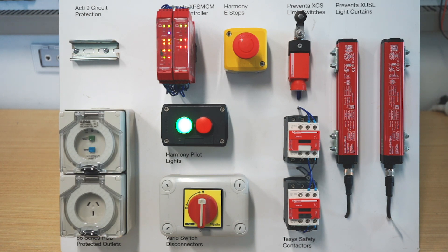The idea is that we're doing a pre-start check for possible welding of the power contacts before you start the electric motor. However, the main thing to appreciate is that what you need for your particular safety system could differ quite a lot as a result of a risk assessment.